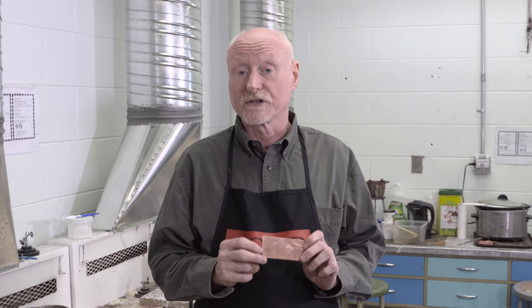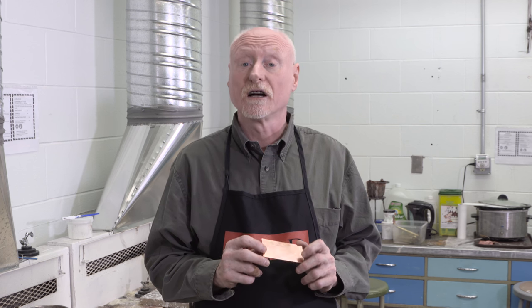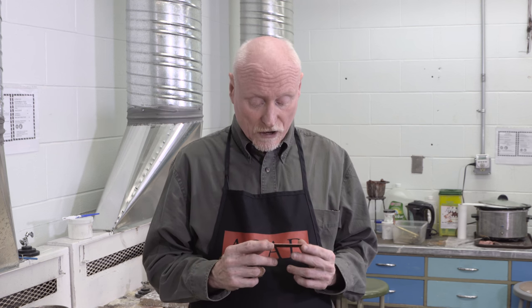This makes no difference at all for pure metals like copper or pure silver. But for alloys, such as any gold alloy or for sterling, it can seriously damage the material if you anneal it too much, too high, or wrongly.